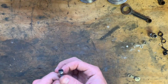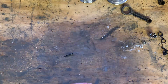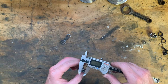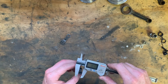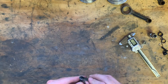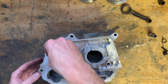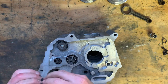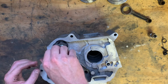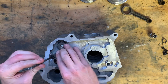Here's my solution to the problem — just got a cap head screw. This hole here is 9mm, more or less 9.15mm. The cap head shank is 8.99mm and the head is 10.10mm, so it's only about half a millimeter lip the whole way around. It's not ideal, but it might work for now. It's all been shortened so the bolt is still a bit long but not too long. I'll make sure it goes into the hole properly — nice. I'll probably redo this with a better sized cap head to be honest.